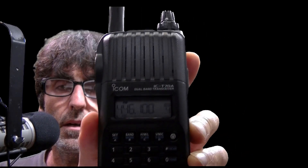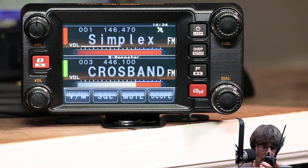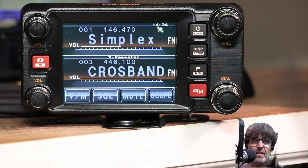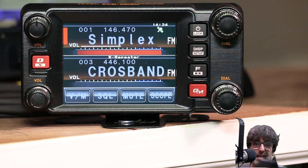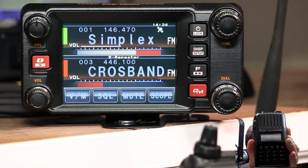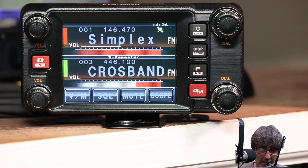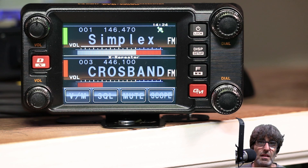I've got my HT on 446.100 — that's where I'm transmitting from. Let's see if anybody responds. I've already initiated contact with John. Can you hear me on this crossband? Got a good signal on you, Rudy — it sounds great. Roger on that. I guess you'll have some viewers out there listening to you on this crossband repeat demonstration. For the viewers, we are about 15 miles apart. That sounds about right. Alright John, I appreciate it — I'm going to get back to finishing off the video.